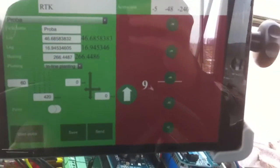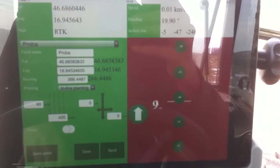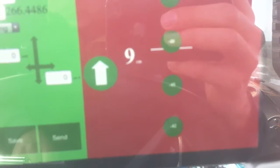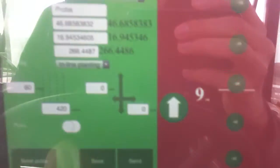I have an extra feature that John Deere doesn't have. I can set up the planting distance and it can give a pulse every, let's say, 60 cm. You can use it as an indicator that stops manually at certain distances. You can see that you have to go 9 more cm for the next plant. I can even set up cross-planting, so the Ardusteer automatically shifts the planting position by half of the planting distance.